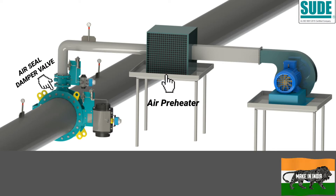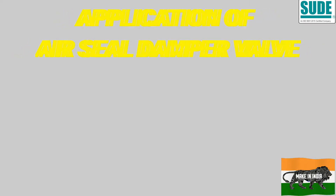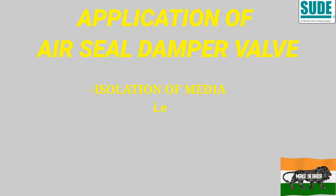Preheater selection is not compulsory, but it is applicable in applications where preheated seal air barrier is needed to protect the damper from corrosion at specified operating conditions. The specially designed seals on the blade edge are made from high-alloyed spring stainless steel, which offers resistance to corrosion and is suitable for high temperatures. The application of air seal dampers is to isolate the media — that is air or gas in the duct line — where 100% sealing efficiency is mandatory.